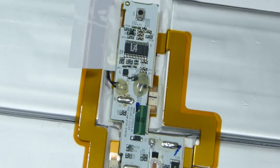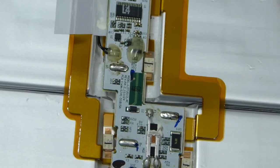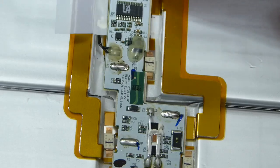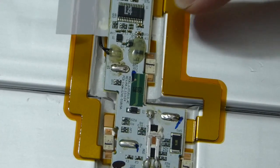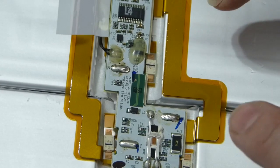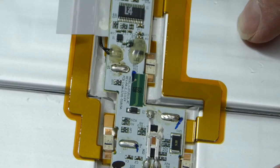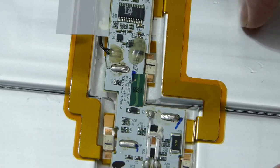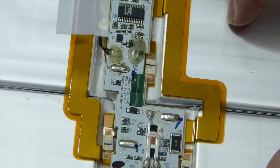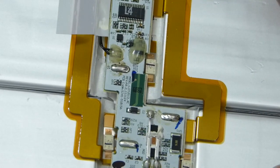Anyway, there you go — that's what's inside a flat-pack lithium-ion battery. This one has control electronics here. This is the electronics that reports back to the ACPI. Can't see any manufacturer's names on there, but this will be reporting back and storing things like the cycle count, the load cycle count, the remaining capacity, and the current drain.